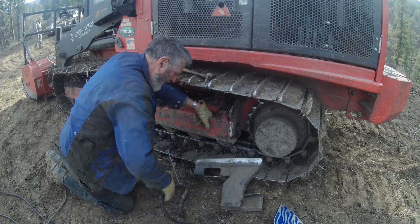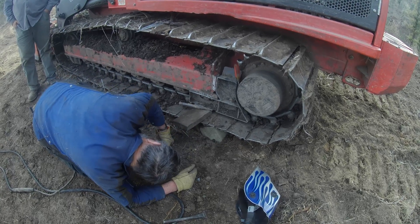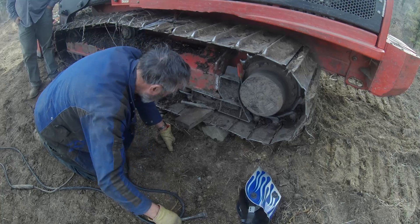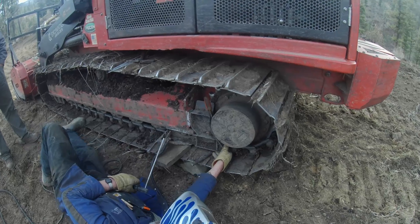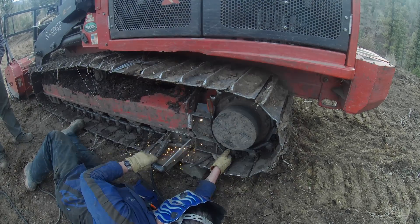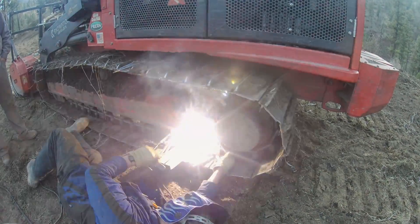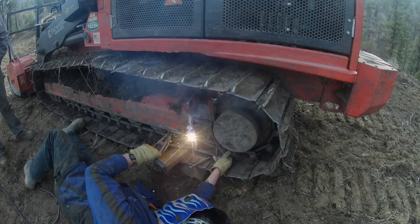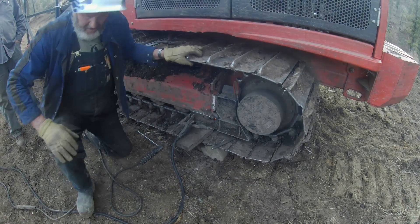I must have left a few welding pieces on the rock guard, so I had to take it off and go back and clean it up. There wasn't any place to put clamps on the rock guard so I could clamp it to the frame, so I just had to keep getting things and attaching them to try and get it up into place. One important thing when welding on something like this — you want to make sure your ground is as close to your work as possible. Otherwise the current can go through bearings and either put bad spots on them to make them wear, or actually weld them together so they won't turn and they wear out other pieces. So you want your ground clamp real close to your work.